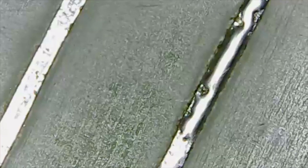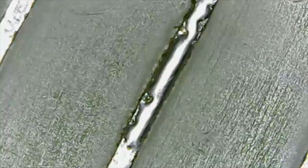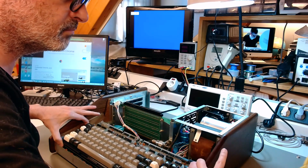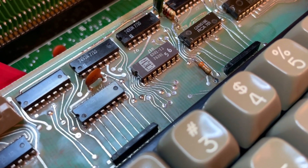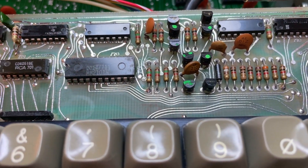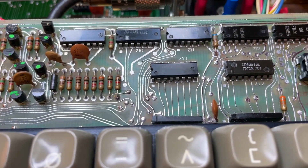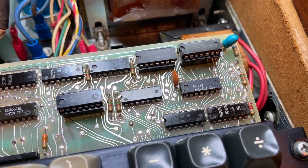Here's another section where the pitting was serious — now there's a very thick layer of solder on top, so conductivity will be top-notch. In one area the pitting was so severe that there was no material for the new solder to grab hold of, but I put a thick layer weaving around the pits, so conductivity is still recovered. I'm quite satisfied. If you see an oily surface, that's the deoxid D5 I put on top of everything to protect it. Everything is continuous, thick, and shiny — brand new metal. It took 47 years for the corrosion to take hold, and this will take a lot more than 47 years to become as bad as it was before.